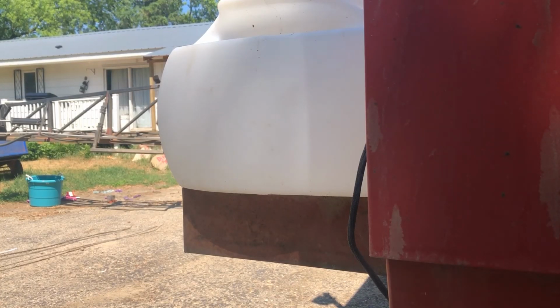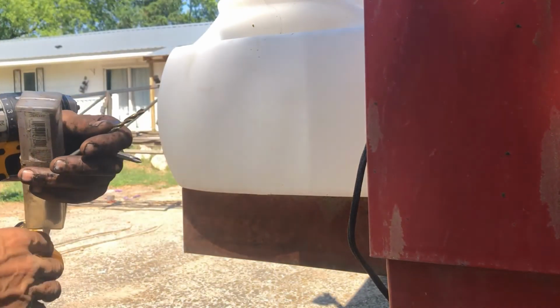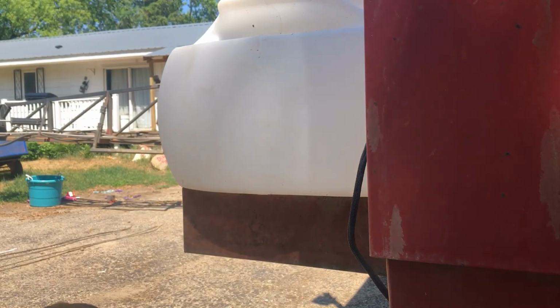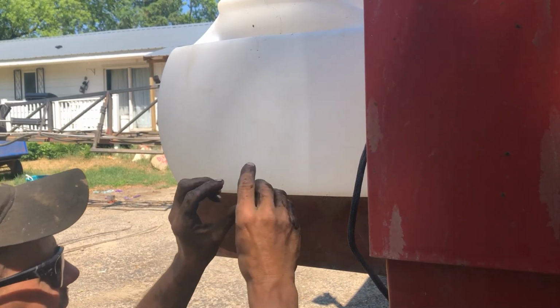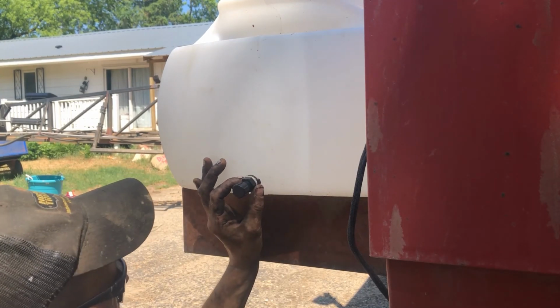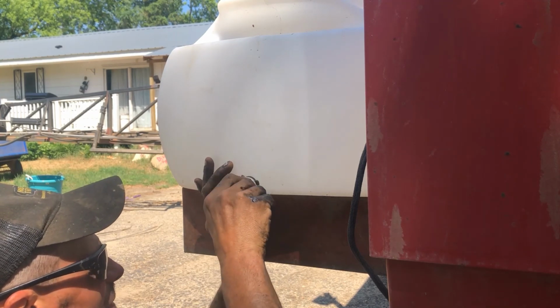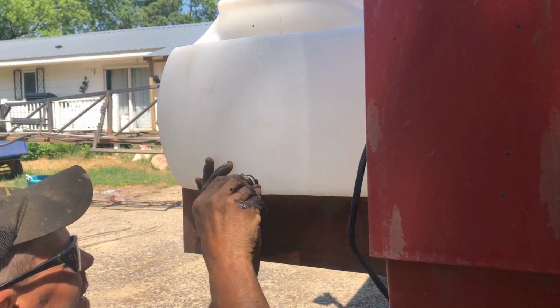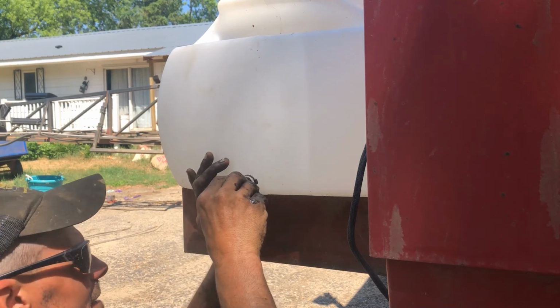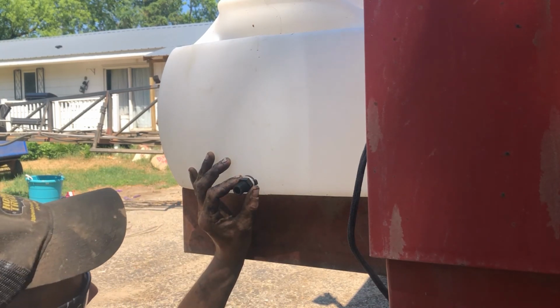Okay, so with this little drain, I went up and I got a couple bits that fit, and I couldn't even tell you what size they are. But what we're gonna do, we're gonna chuck up a pilot. We're gonna hold him just a little off. Actually, let's get off that line. Let's go a touch this way. We're a little bit off the bottom. Off that, you can see where the mold mark is heavier. We're not gonna get perfectly to the bottom.